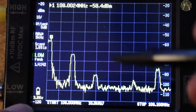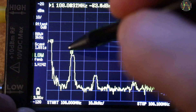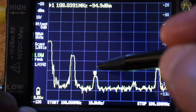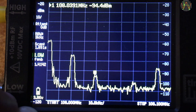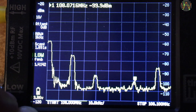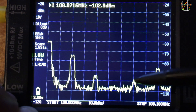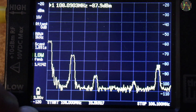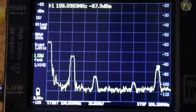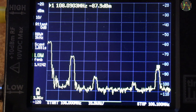I tried to reproduce the spectrum with no audio. 108 MHz is on the far left and the span is 100 kHz. We have the pilot tone at 19 kHz, the peak for the left-right audio at roughly 38 kHz. The next noticeable peak is at roughly 71 kHz, which could be something in what the Wikipedia drawing calls the direct band. There seems to be no trace for RDS — it could be tiny and in the noise. Finally at about 90 kHz there is a sub-carrier, but I have no idea what it is used for. All in all, the transmitter seems to do its job.